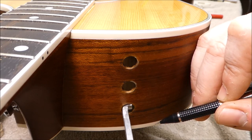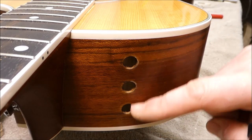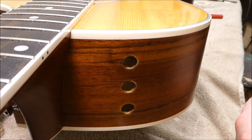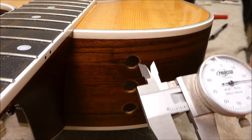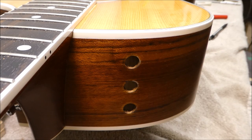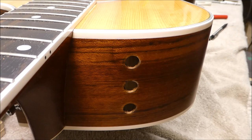Just using my little right angle measuring rod here to figure out the thickness of the sides in this area. The plugs I'm going to create will not be the same thickness — they'll be slightly proud of the surface by maybe a sixteenth of an inch or so. I wouldn't want to try and match them up perfectly; that would be a very big operation and kind of expensive. The other thing is these holes are a weird diameter, like 427 thousandths which is about 10.8 millimeters, so you're never going to find a plug cutter that'll cut an accurate hole for this — unless you wanted to create a CNC program and cut them with a router. So the options would be to drill this out to 7/16 or half an inch, or just use them as they are and create plugs that will fit in there reasonably well from the inside.